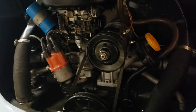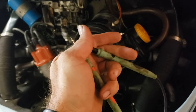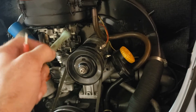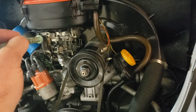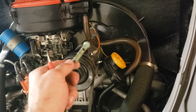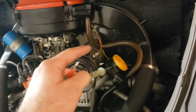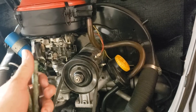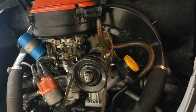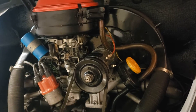If I touch the probes together, we get a beep because there's a connection there. So with the wires unhooked, I'm checking each wire to ground to make sure it's not touching ground. What that looks like is putting the probe on the red wire while unhooked, then touching the other probe to ground such as the generator case, making sure it's not shorted. None of these wires when unhooked should show ground. Make sure they're unhooked — that's important — because if they're hooked up, just about all of them will show ground because you've got your whole circuit connected through the battery, which is grounded.